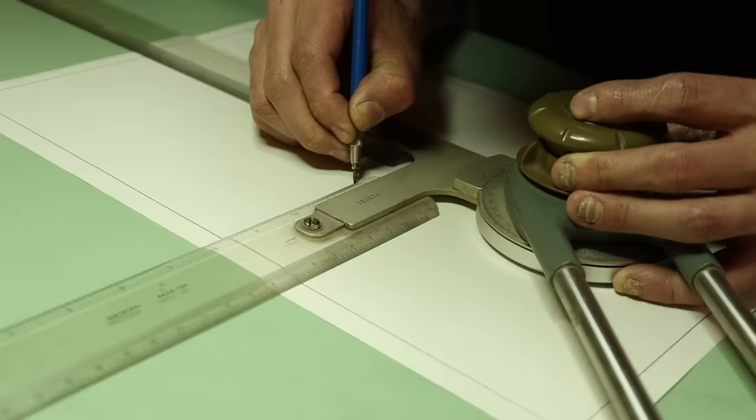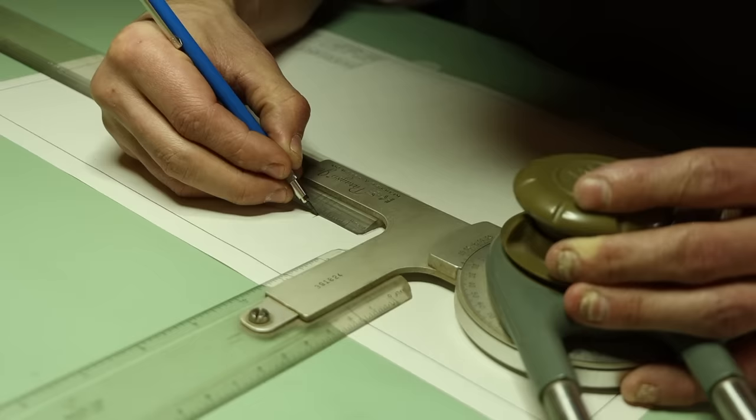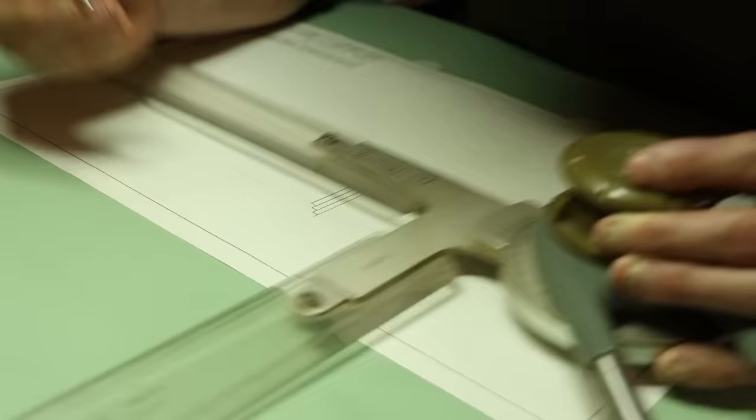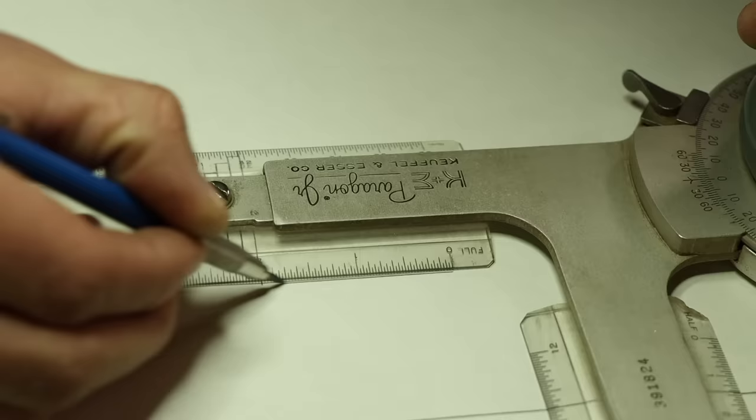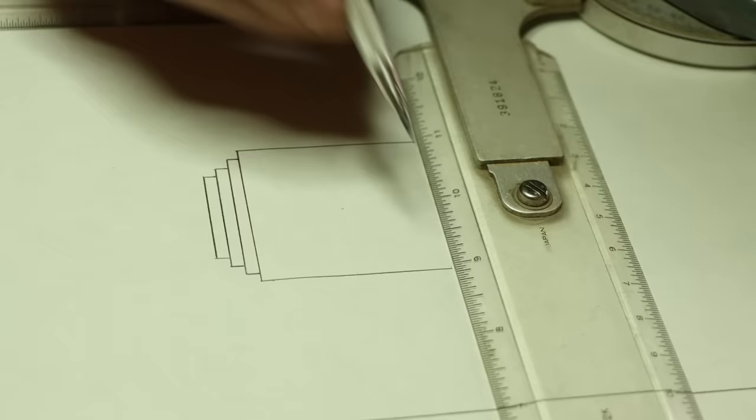I mentioned before that the multi-diameter blade hole adaptability was a good idea as well. My attempt will include a similar step centering boss, but all in one piece rather than a bunch of nested rings. I'm also going to make the boss significantly longer compared to the slim profiled rings, and this outside diameter will be a tight tolerance slip fit inside the end of the R8 arbor. The combination of all these features should be a huge improvement on the ability to center the saw blade.